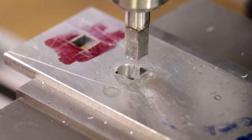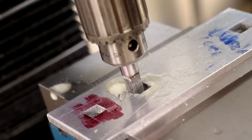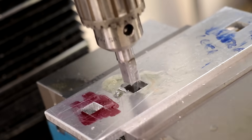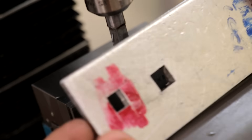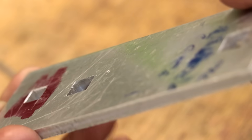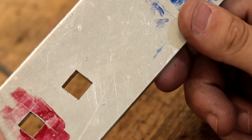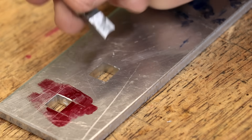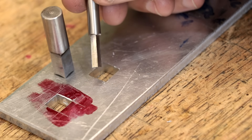The process is pretty straightforward from here on. If you do all four corners and you do it correctly, you'll be left with a spot-on square hole with very sharp corners. Those chips look pretty respectable, and that is a really good surface finish — much better than I could get from any of the other methods. Overall, I really like this method and it really doesn't take all that long. Just make sure to keep the cuts as light as possible because you don't want to strain your quill too much. I really like this method because you can use one cutter to create a range of different sized holes. In fact, I only really need to make two — a small one and a large one — and that should be a complete set.